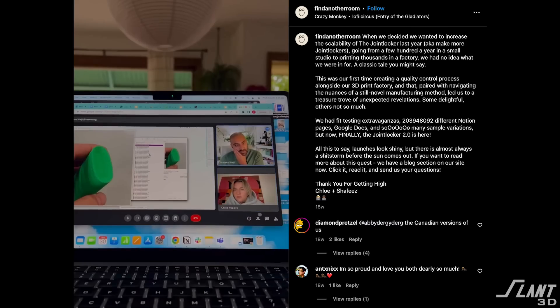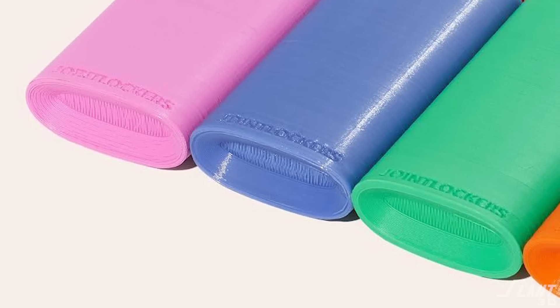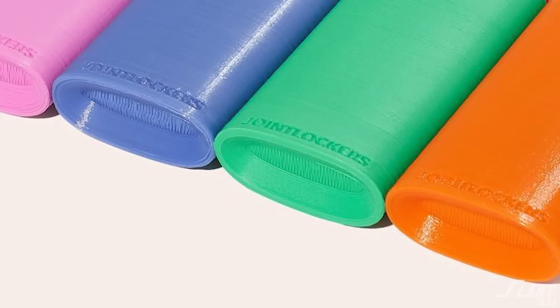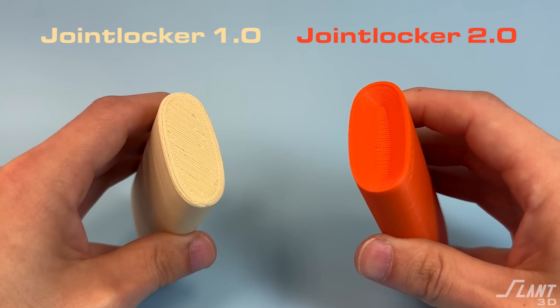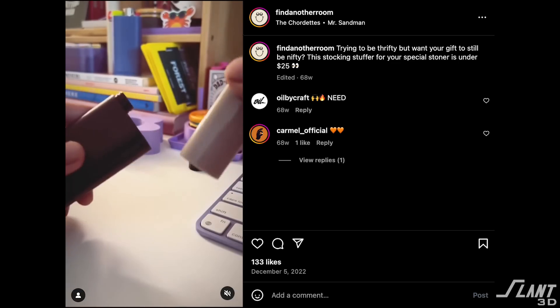The very first step was to eliminate challenges with the bottom layer. We ended up creating a cavity inside the bottom so that it has minimal contact with the bed, which eliminates the chances of staining as well as any layer mismatching that can cause the bottom to go wrong — which was actually an issue in early batches. After that, we readjusted the overall dimensions.